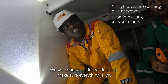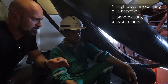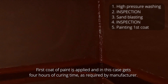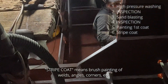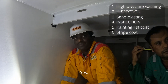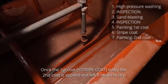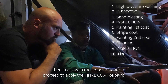We will do the inspection — if the quality and everything is okay, and then you do the inspection and decide if it needs to be redone. He does his measurements and tells you when you're good to go. The first coat of paint is applied and in this case gets four hours of curing time as required by the manufacturer. I spray this white color — this is the stripe coat. This covers the welding areas, the welds, and edges — done by brush and roller, because by spray you will not reach those areas. Once the first coat is dry, the second coat is applied and left eight hours to dry. Once that's done, the tank is cleaned and inspected again.